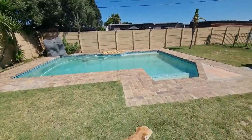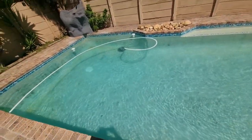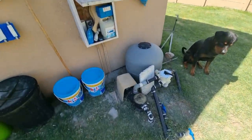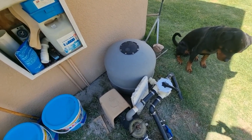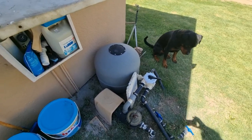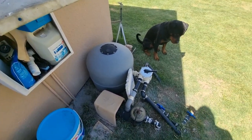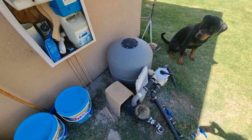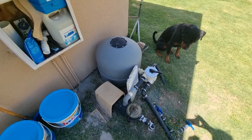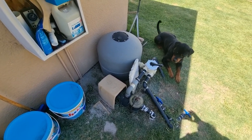So I bumped into this chap at the shop and told him I was at a loss. He said: if you let your pool go green and then clean it and vacuum to waste, there are still a lot of microorganisms and rubbish that you don't really see — and that gets clogged in the filter. He told me to open up the filter, put it on backwash, get your arm in there, give it a turn, feel it, and loosen all the solid stuff in there. I did that yesterday and it helped a little — she's running about 10 minutes. I can feel there's still a lot of grime in there, so I'm going to do it again and hopefully get a better result, maybe even a third time — that'll give me an extra three to four months with the sand as it is.